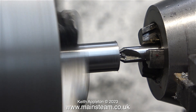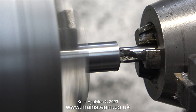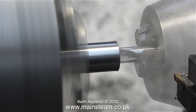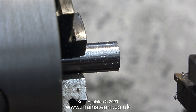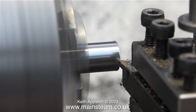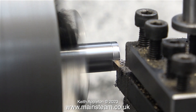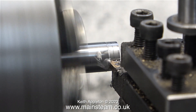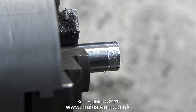The next part of the job is to centre drill the end — not too far, not too deep. These shallow centres at each end of the crankshaft are only there to give the effect of the crankshaft having been turned between centres, which it probably would have been had it been a full-size one. With the facing done and the centre hole drilled, it's time to turn down this piece of bar to allow me to fit the crank web on the end of it.